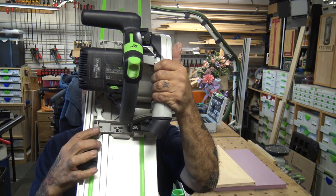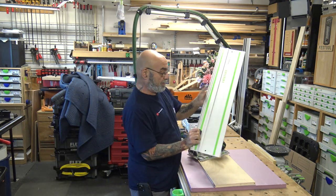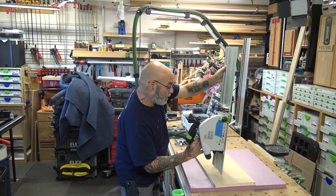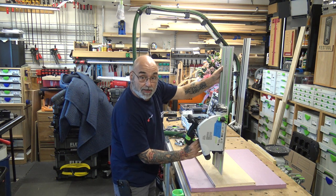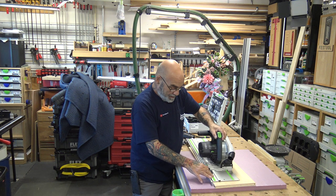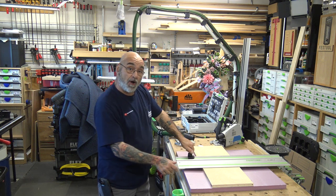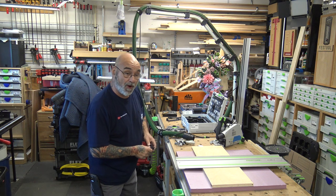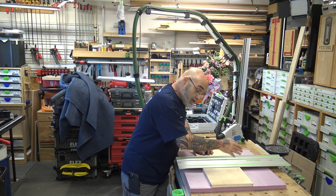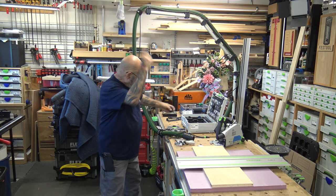The little piece on the guide stop also locks into the saw housing. If you're doing a horizontal cut — say you have the rail mounted on a wall and you plunge the saw — the back of the saw can kick back as you're plunging. That protruding piece actually holds the back of the saw from pulling up. I noticed this, looked it up on Festool's search, and found a video explaining it. So besides being a plunge cut stop, it also prevents the back of the saw from kicking out during a vertical cut.